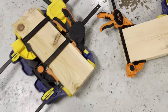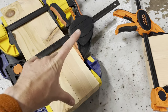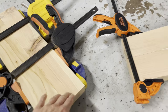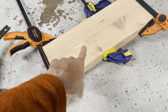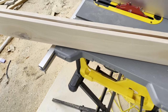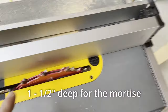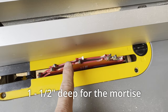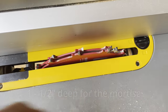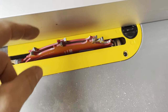Because I have the footer, or that's what I'm calling the footer, there's the wide bottom horizontal pieces, and then that'll be the top one that I just glued. This is the full vertical position of the door. And I just use the dado to cut a 3/8-inch groove all the way down. I have the stacked dado with two blades and a chipper inside, just cut to, again, 3/8-inch width when you put all three of them together.